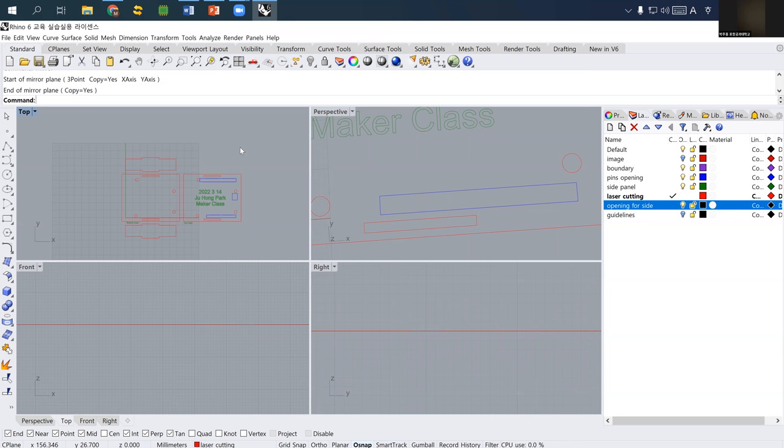Even you are welcome to, I just use this one as a 5mm offset from the original PCB size, but you can think of it that you can even offset like 10cm wider, so you can have stronger support to prevent this kind of thin side panel. And I am actually showing you a very optimized, so-called really minimum material design way.